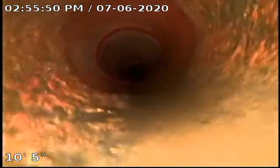And here's the cast iron. This area was descaled — we descaled from both stacks all the way to the end of the cast iron. The only area we could not descale was through the backwater valve. But we've been able to clear everything out, and everything is in good condition at this time.